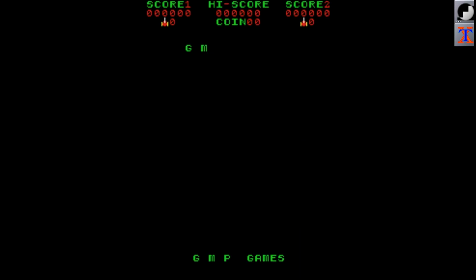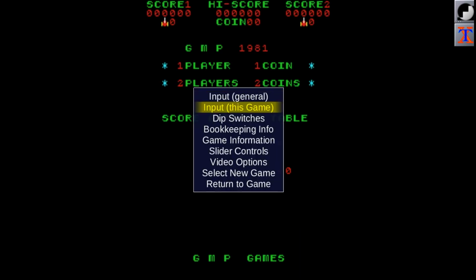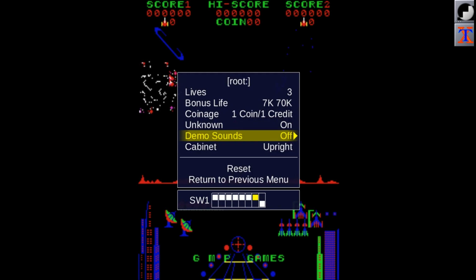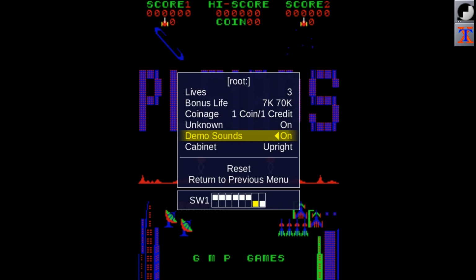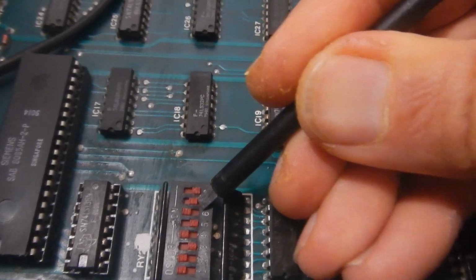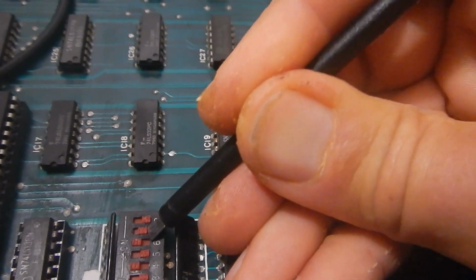Now, since I didn't find any other good explanation, I wanted to check again the ROM dumps on MAME. And, as we can hear, flipping one dip switch enables this continuous noise in attract mode. So let's flip the actual dip switch. Yeah, that was it. Unfortunately, there's still something bad. Listen to this. It is a kind of oscillating noise and it's not so loud, but it's surely not normal.